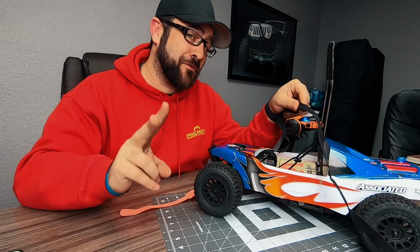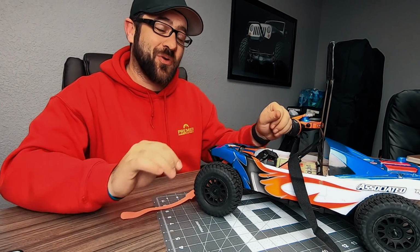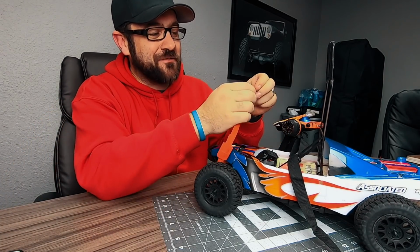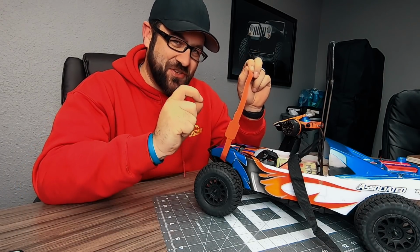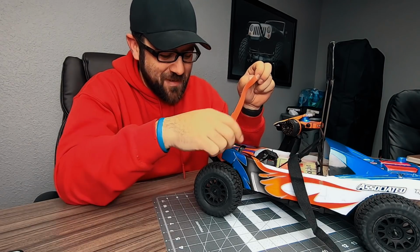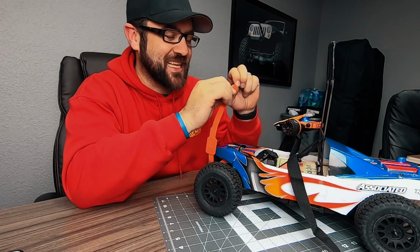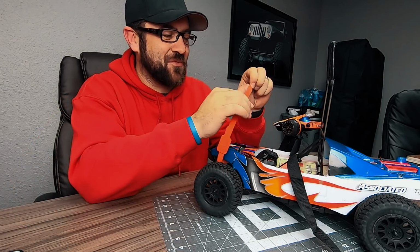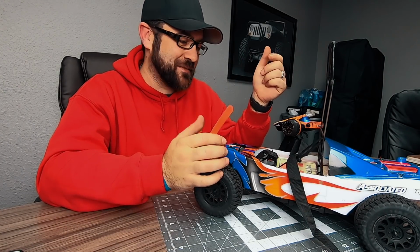So after two failed attempts, I did get it to deploy properly, first to show that it works. The failed attempts were because the amount of overlap on this Velcro strap is one of the tricky parts. It's just this tiny little amount, and that makes things pretty difficult to gauge because it's got to be on there well enough to hold it while I'm trying to get an approach, but not so much that when they hit the servo, it doesn't actuate.